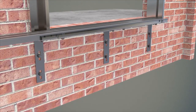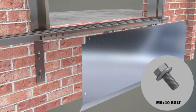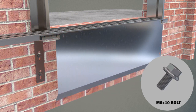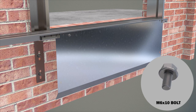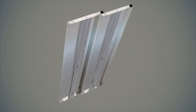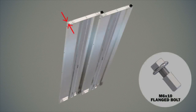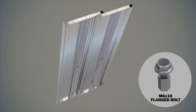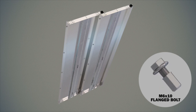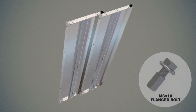Silicone sealant molding is applied on the two sill plates to fill the lower rail gap. The lift landing door bottom plate is connected to the sill plate using two washer head and hexagon head metric 6 x 10 bolts. To complete fire molding assembly, the fire molding from the package is connected onto metric 6 rivet nuts located at the narrow side of the panels using metric 6 x 10 hexagon head flange bolts.